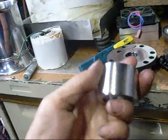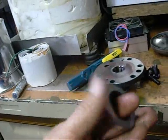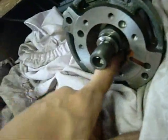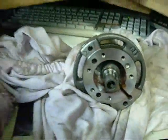On the rotor you can almost see a patch where the vane must have been jumping and then hitting it, leaving this score mark down the side of it, and then riding it hard all the way around because it's all scored. They're not deep scores - you can barely feel them with your finger, not even record grooves. A micrometer would tell the tale on this one. Even the inside bearing surface is actually pretty good. But you can definitely see all through this whole housing here it's rough - all the chrome's gone. The chrome's obviously been spat out into the housing, all down to copper.